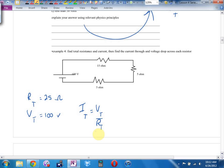Right, I'm using V equals I times R. I told you this is the equation we're going to be flogging to death, and you'll end up memorizing it. Katie, V equals I times R, get the I by itself, yes? Katie, what's the total current running through this particular circuit? By the way, if I asked you that, make sure 4.0 if it was a final answer, 2 sig figs. So, what's the current right there, Katie? Look up. What's the current right here? Yes, that's Kirchhoff's law. What's the current right here? Yeah. What's the current right here? Yeah. Do I know 2? Then I know 3. Actually, I could find the power if I was bored as well.